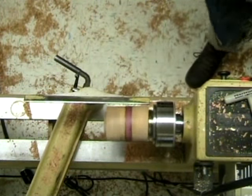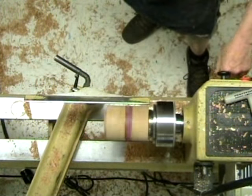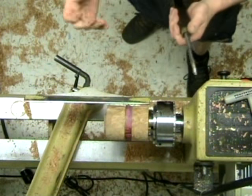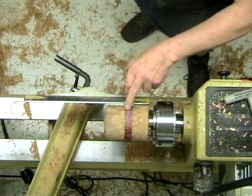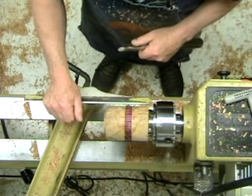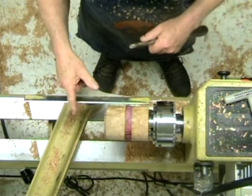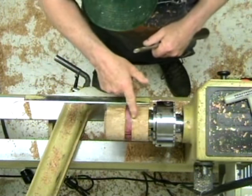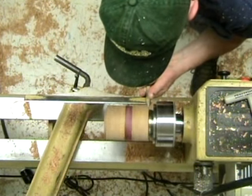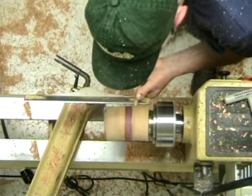Now what you can do is get the spindle gouge and cut into the contrasting piece of wood only about less than a quarter inch, about a quarter way, in other words. Don't be tempted to keep going. What happens if you keep going? No? Okay, you see the way that's off-center? Well, you'll take too much off one side and you'll never get the grain matching. All right? So just cut until you're happy that... Now, this actually has a tiny bit of flat in it, so I'm going to take a bit off this as well.